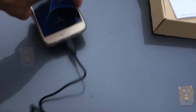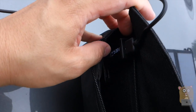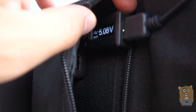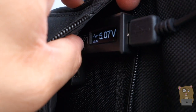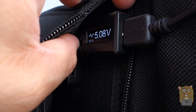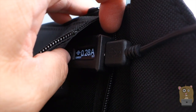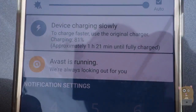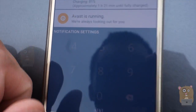It's connected to my Samsung Galaxy S7 right over here. I'm going to try to position it so I can get at least four of the panels charged. Currently it's outputting at 5V — almost 5.1V — and it's generating about 0.3 amps right now. It is cloudy in New Jersey. My phone's at 81% right now, and at 0.3 amps it'll take 1 hour and 20 minutes to charge.